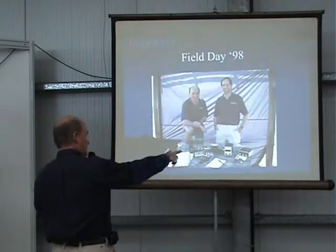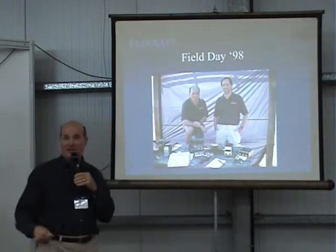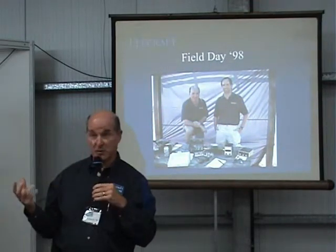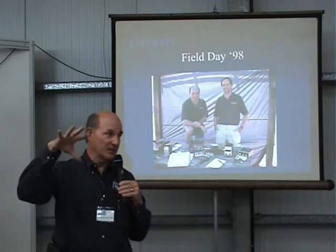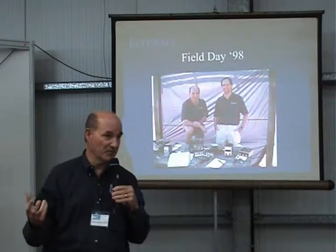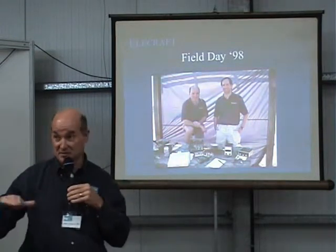It's a little different culture, but we had a little fun with that. In 1998 also, we had the first two K2s at Field Day. And this is where we sort of realized we had something going. I had started working on our first prototype several months earlier and recognized that we could push more performance out of it by getting the phase noise down, pumping up the front end to get better dynamic range, and balancing the system out.